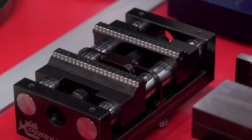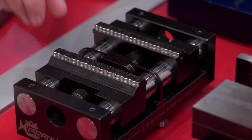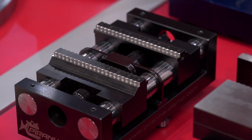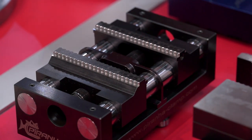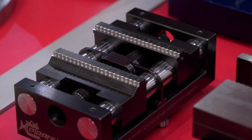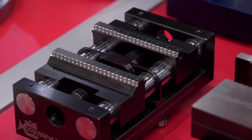You say a lot of clamping force — does that mean you don't need to pre-stamp? That's right, we don't need to pre-stamp. We do it already on the vise. We have two rows of teeth: the first one goes into the material like a form clamping, and the second one has a different angle and holds the material down. That means if we have higher material, we don't have any vibrations on the surface.